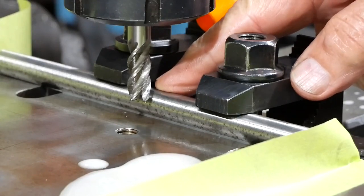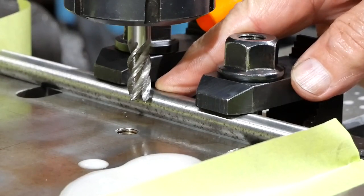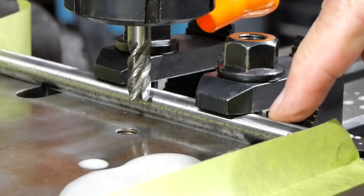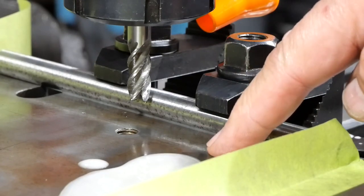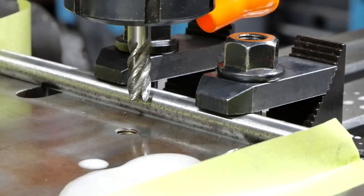Okay, so getting ready to mill the flats to put the screw fixings through. And I've got some bits of tape on the plate. I don't know whether it'll help or not, but the coolant was running off in all directions, making a big mess. It'll help, maybe, maybe not. The coolant is really dirty at the moment, and that's in part because the belt-style oil collector that I made, the belt has stretched and it's stopped working. So that's another project to revisit. But in the meantime, I've got oil contaminated coolant.